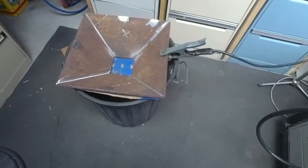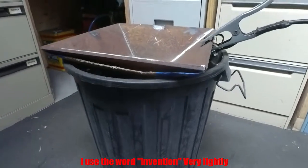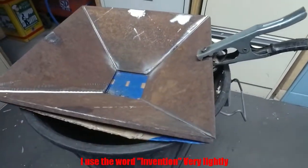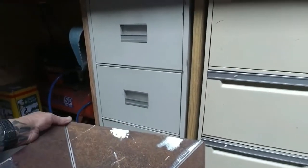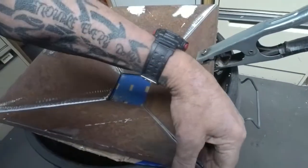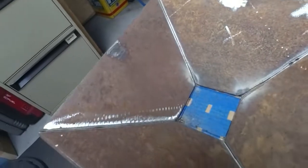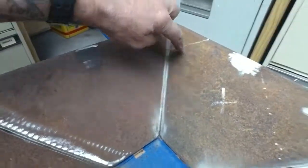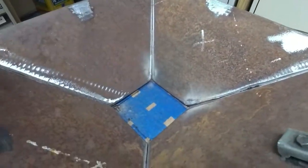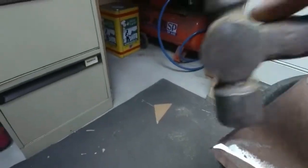Okay, so here is my invention — it is a rubbish bin. I've got the steel inside the cardboard cutout that I made, which holds the base together pretty well. I was having trouble with these outside corners splaying out, so what I thought I'd do is drop the whole thing into the top of this rubbish bin, which puts pressure on the outside corners and pulls them up, allowing me to get my little hammer in here and tap the corners to get them nicely into shape.